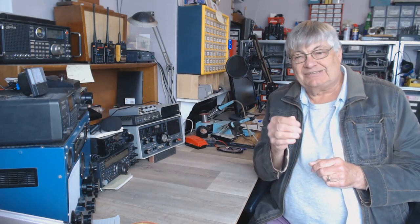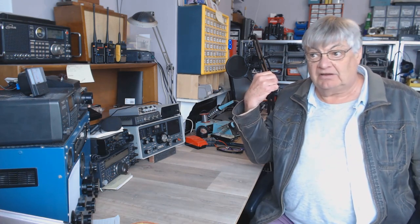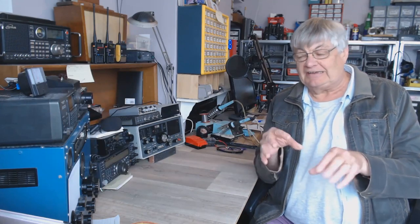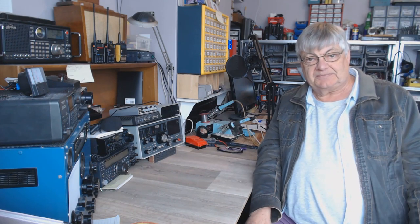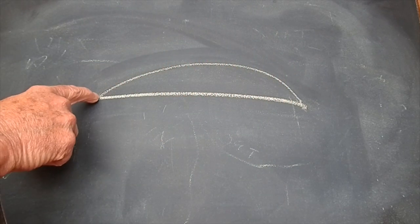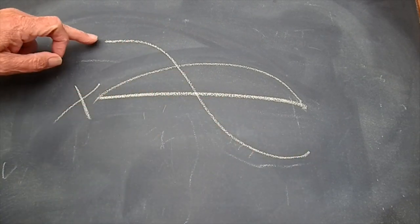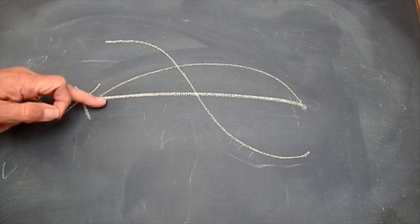I'm feeding this one at the end. I can't get to the middle of it because the wire goes all over the place — down the alleyway, behind all the houses. It's a stealth aerial, I'm hiding it. So back to the blackboard: half wavelength on the frequency we're using — no current at the end where we're feeding it, high voltage. This is called voltage fed. A quarter wave: current goes from high at the feed point down to minimum at the end — current fed.